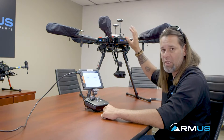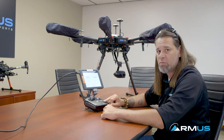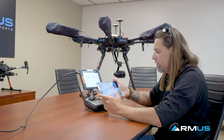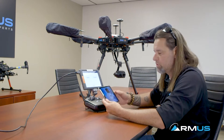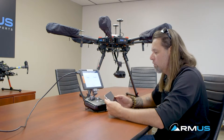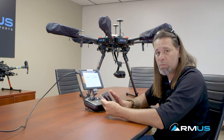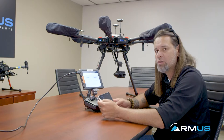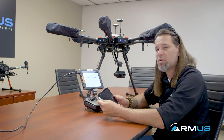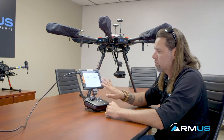In order to do this, M600 — we've got the Z30 mount and the X-T2. On the radio system, we're running a Crystal Sky, but we could use an actual iPad if we wanted to. That's traditionally what we use when flying the M600, but you do have to use the X-T Pro app. The X-T Pro app is not really intended for inspection purposes — it's meant for the public service guys. It also doesn't track flights specifically within the app. It will work with an iPad, but today we're going to show you how it works with the Crystal Sky.